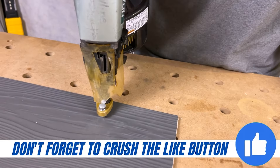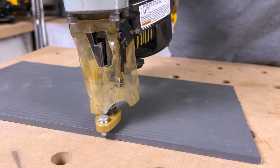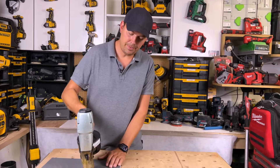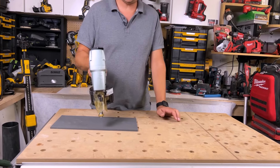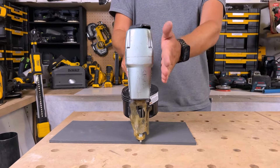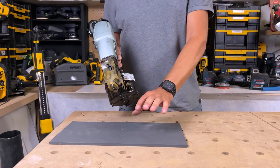It's not gonna stop you from doing any type of face nailing, but it's really gonna help you when it comes to shooting in the right place. If you start to rotate your gun up like this, you're gonna get your nail too high up. So make sure you're holding your gun at 90 degrees to the work surface, nice and plumb, and then that'll put your nail in the right spot. Perfect for lap siding.